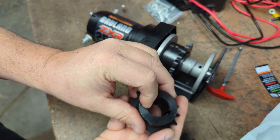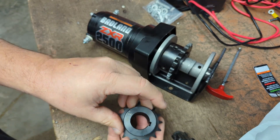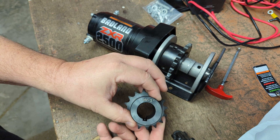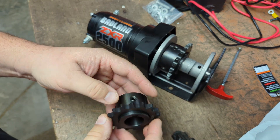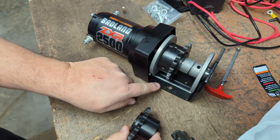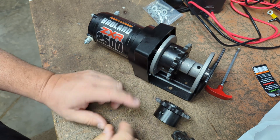I'll have to put this on the lathe. He's got some caliper measurements from the trailer handle — I think it's 1.2 inch. He's going to re-measure it today to be sure, but I'll have to bore this out on the lathe. I think there's plenty of room and thickness on that big old piece of steel to do that. We'll be set — should just be able to slide these on, slide this on the handle, get this mounted, figure out the chain length, and hook it up.